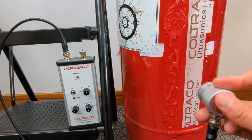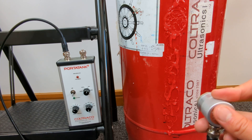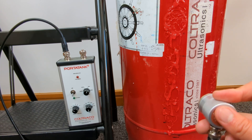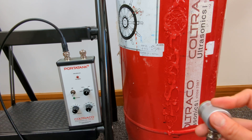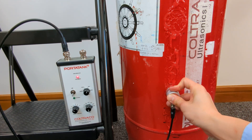If you do not know where your liquid level is, please ensure that your sensor is placed as low as possible on your cylinder to ensure that position 2 is indeed below the level. I will now place my sensor at position 2. At position 2, because you are below the level, you must ensure that your level indicator is on.